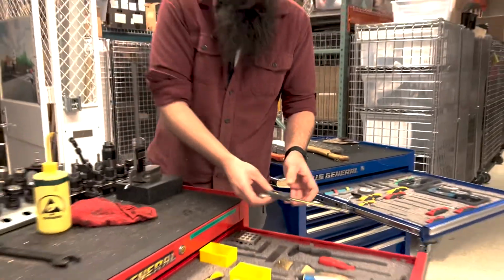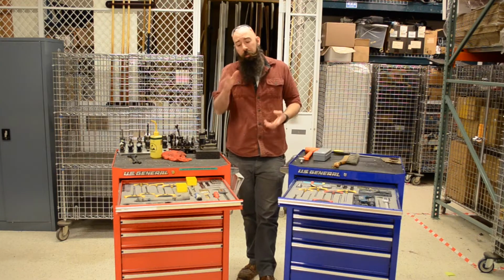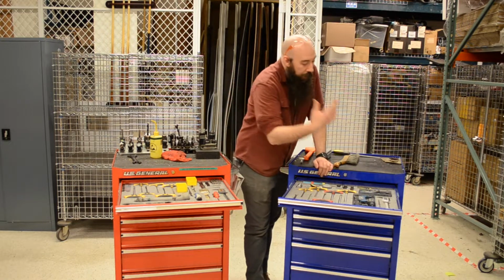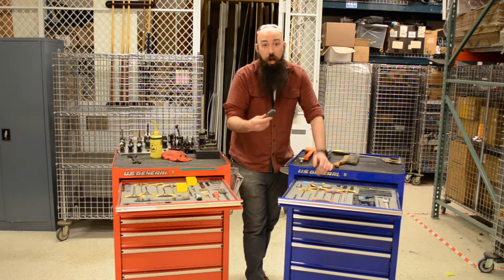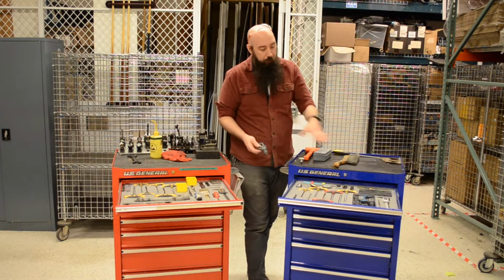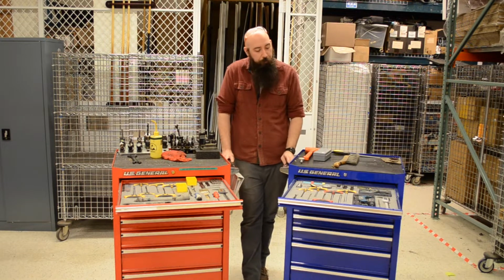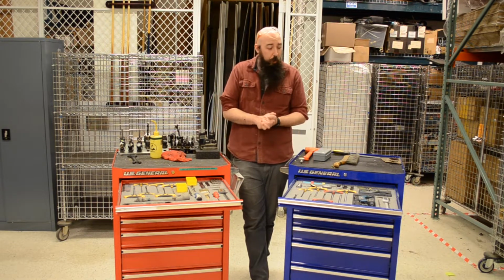It's just super helpful. This is something you might want to spend a little bit of money on, just because buy once, cry once. For the mill calipers, often for lathe parts and mill parts as well, it's going to be a micrometer, which is just another level of accuracy. We have a 1 inch and a 2 inch for our lathe kits, since it's all round parts. But we also have a caliper in there as well. So those are some measurements.